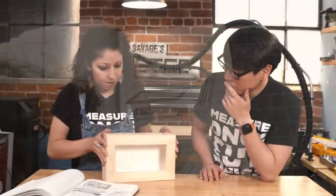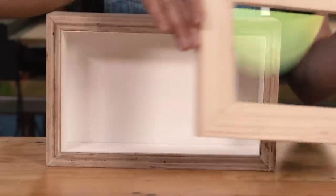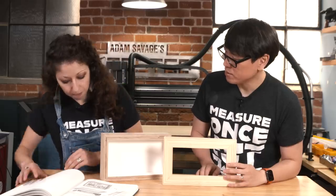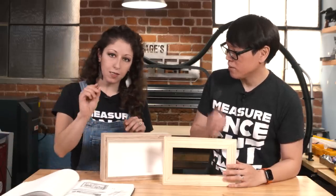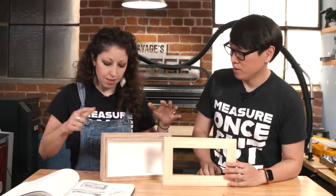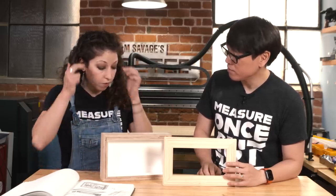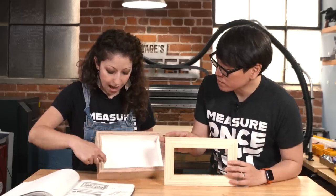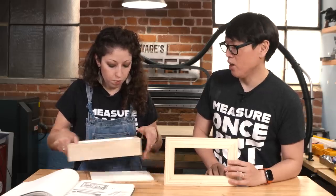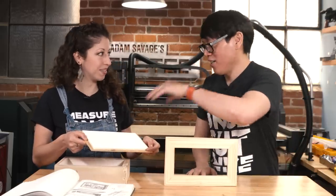And the way that I thought about this is there's three basic components. So there's a lid that's going to go on the front, and this will remove off. And we will attach this to the box with some magnets. They rolled away here, but we'll just use some little earth magnets that will countersink in there on the back of this and on the front piece here. This is the main box construction, so this is where all of the parts are going to be kind of viewed into. And this has a mat board liner all the way around. And then there's a separate back panel, which pops out. That's going to make mounting the pieces, transferring from the knolled layout to here so much easier.